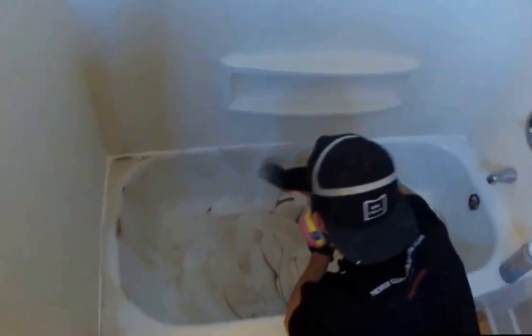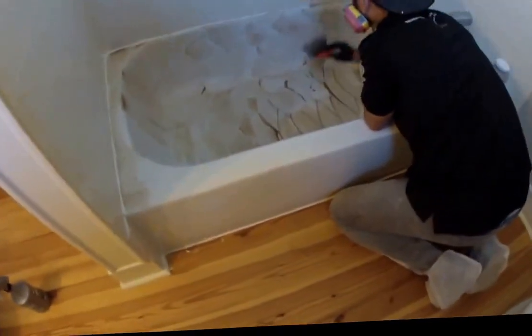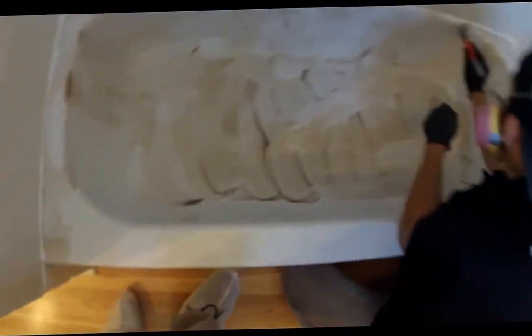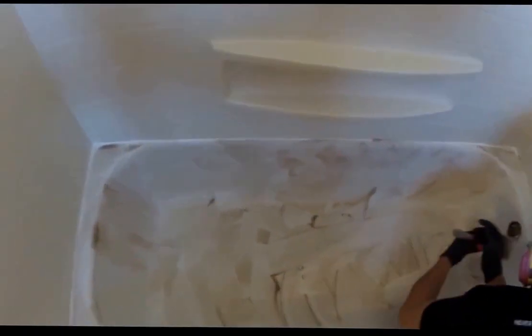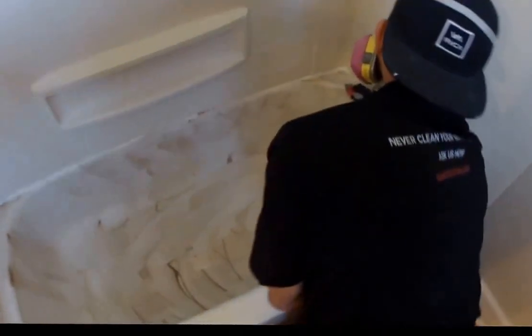we're here applying the acid. He's almost wrapped up here. Once he applies that, he lets it sit for approximately 5 minutes. And then he'll return and wash all of it. And then he will hit the whole surface with a razor blade and ensure that there's no more discrepancies or left particles from the acid or soap scums, things of that nature. And then he will entirely hit the surface with a wet sand process, mechanically and by hand.